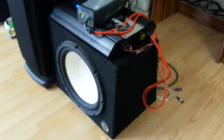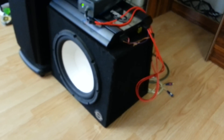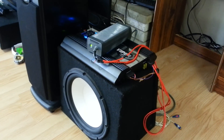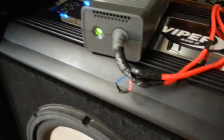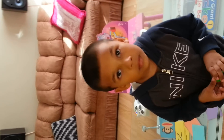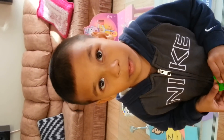As you can see it's decent. It's in a sealed enclosure, which is not optimal for performance in a big living room — you'd want something ported — but it does the trick and I've been playing it with nothing overheating. When you splice into your four yellows and four blacks, just tape everything well with electrical tape, keep everything isolated, and it's probably the cheapest 12-volt power supply you can find.